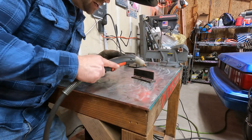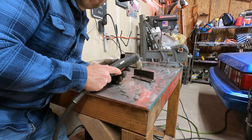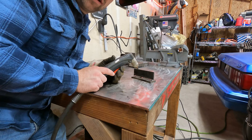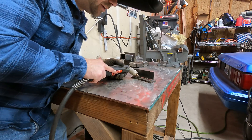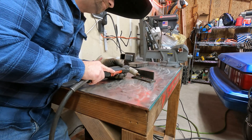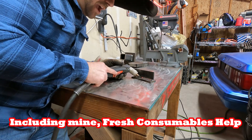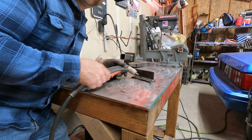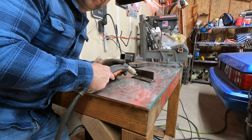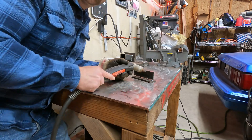We're not trying to cut through this plate — we're trying to get rid of the weld that's in this plate. Naturally, you're not going to point the torch straight at it because the air jet follows it and tries to blow straight wherever it's going. So you're going to run your torch way laid back, almost at the most angle you can get it at and still keep the arc lit. Some plasma cutters are finicky about arc length. Sometimes you may have to tip the torch in to initiate the plasma arc, and once you're going you can lay back on it and just work that weld out of there.